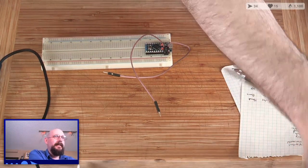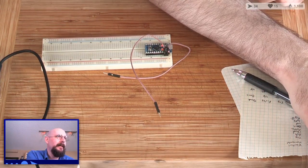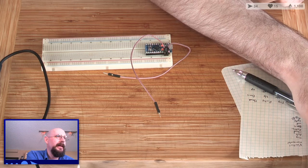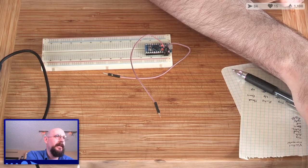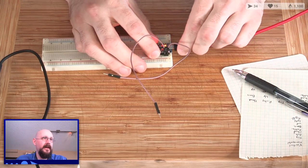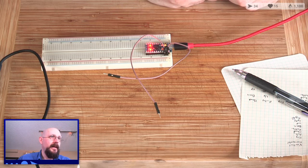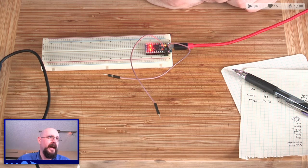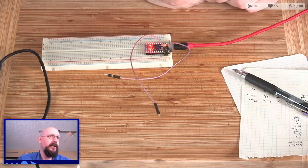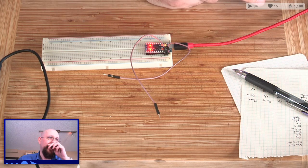Wow, that's too big. Make smaller. Okay, so driver installation. Download the firmware archive and unzip it. Connect the board to the USB port in Windows and it will detect new hardware, Arduino Leonardo comms, or just USB serial device under comms and ports. It's most likely to offer to install the driver. If it doesn't, use Control Panel, Device Manager, choose your board, right-click the unrecognized device, and choose Update Driver. Browse my computer for the driver software.